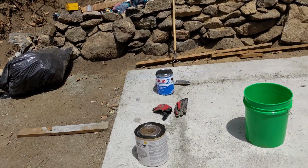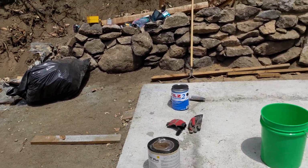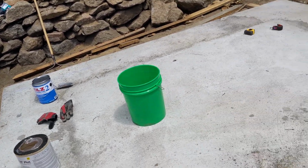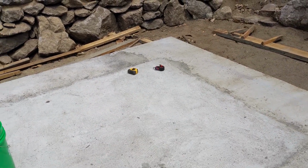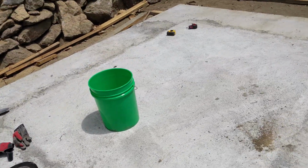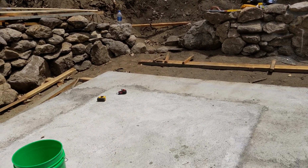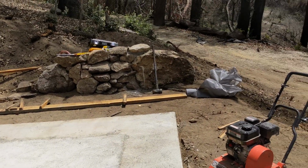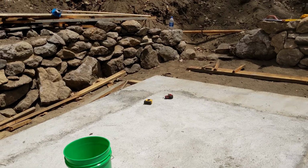So if you imagine it's on a concrete base, if moisture wicks up the concrete, it'll wick into at least the bottom of the hempcrete possibly. Kind of peculiar reaction, and maybe starting to rot it or something. The hempcrete properties, it's got the lime in there, so it really reduces any option for termites or insects. We have rats up here, pretty crazy, or they used to be before the fire, much less so now, I expect. So no mold will grow on it, supposedly.